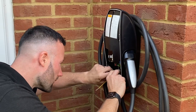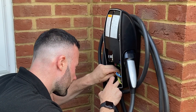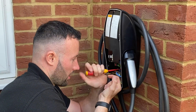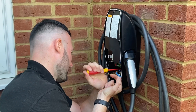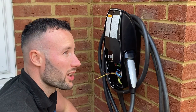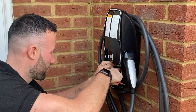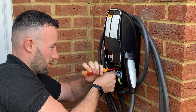At the stage of connecting up the charger itself, Matt — for a lot of electricians thinking about going into EV charger installation, they're probably really nervous about the actual connections inside the charger. Can you talk us through it? There was a bit of head-scratching, got the notebook out, drew a few wiring diagrams, then opened the cover and saw: live, neutral, and earth. So basically it's just a glorified shower, isn't it? Yes, very simple to connect — line, neutral, CPC and you're away. Tesla have given us a nice bit of room to work in as well, so that's always an added bonus. Thank you Elon Musk!